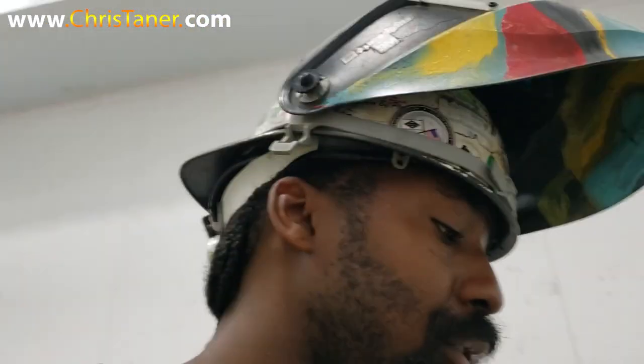Certain parts of welding pipe, some people have more trouble than others, but for the most part, that's what I do. Sometimes I don't get to do a certain process of welding for a while, so I know I'm going to be a little rusty. So that's what I do. I talk to myself. So look, loosen up. Don't squeeze too hard. You got too much pressure on the TIG rig. Okay, things of that nature. That's a good little pointer you can keep in mind, because it does work. It might save you a little heartache. And I'll be back.